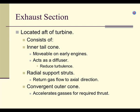There are two cones on the back — an inner cone and an outer cone. The inner cone used to be movable on early engines to adjust the port shape. But that became problematic because it's in the hot gas path: bolts in the hot gas path seize, corrode, and erode. They're very expensive and brittle bolts due to the materials used, so it became impractical and you don't see that much anymore.